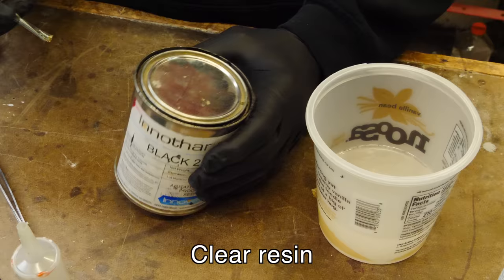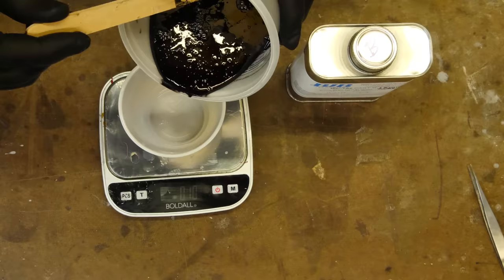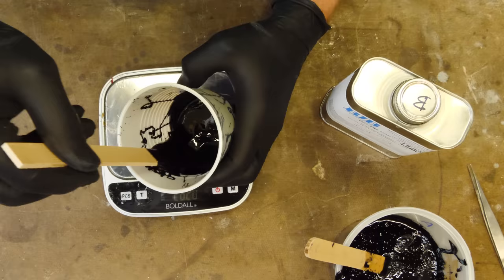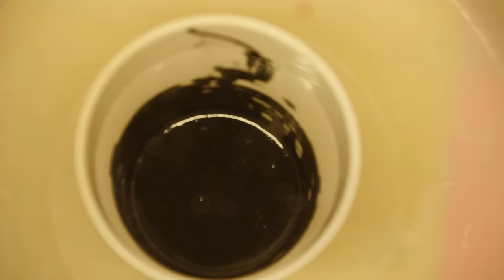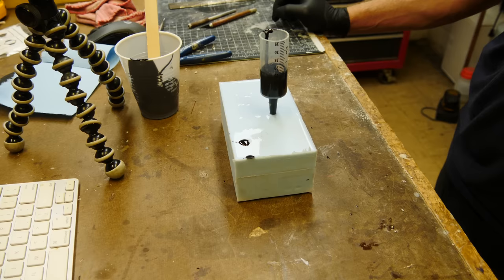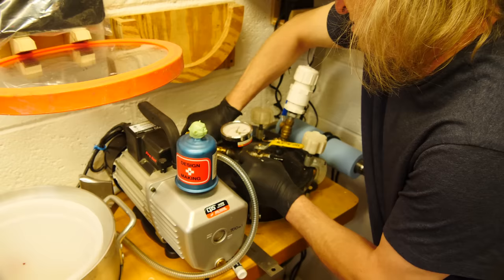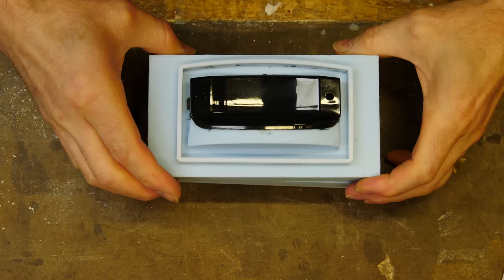I need to make black parts. The best way to make a black part is to use clear resin — that way your pigment does not have to overcome the opaqueness or natural color of the resin. I'm using a water-clear resin from BJB Enterprises — I'll leave a link in the description. Into the vacuum tank it goes to degas the resin. I'm going to let gravity do the work since our pour sprue is at the low point and our vents are at the high point. I cut off a syringe and use that as a makeshift funnel. You'll see the resin start to weep out of the vent holes. Into the pressure tank it goes and it cures at 60 PSI so that any remaining bubbles get crushed down and you get a perfect part. All that remains is to remove the part from the silicone mold.